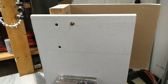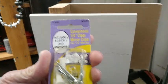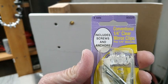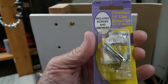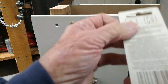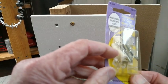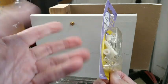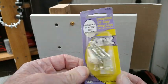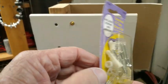Let's go to one that you have to insert or screw in. There are a lot of variations on insert types. These insert types typically have little ridges, so when you push the thing in it doesn't particularly want to come out. They're also split, so when you put the screw in after getting it in the drywall, it forces the insert open, giving you more traction inside the drywall.